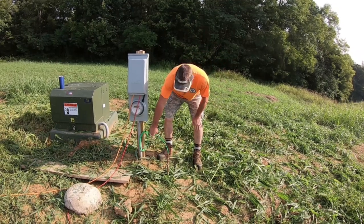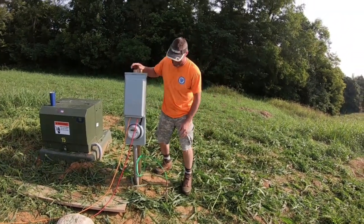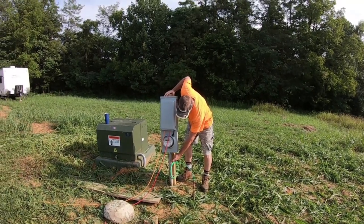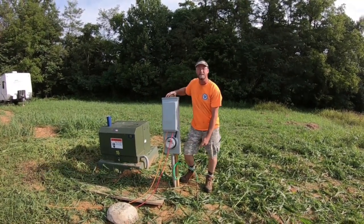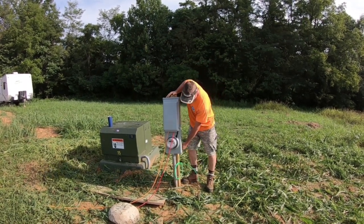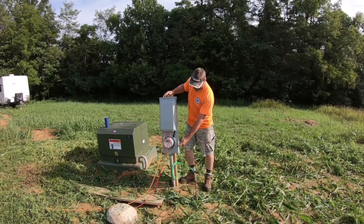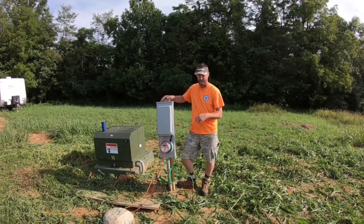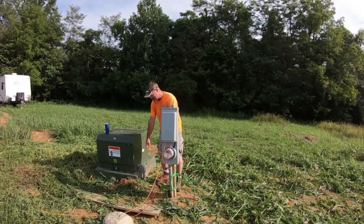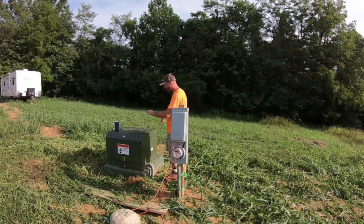I have extra ground wire here. No biggie, I just had it and I didn't want to cut it, so I wanted to use it. And you bring that up, and also you had to use a certain type of conduit. It has to be gray because that's electrical service, and it runs down into the ground. Once it runs into the ground, inside this I have the three wire that connects to the meter. I think I've got some photos of that. And that goes down into the ground. I actually just leave it sticking up out of the ground over here, rolled up in a roll. I have to have at least 6 feet for the electric company, rolled up and sitting here.